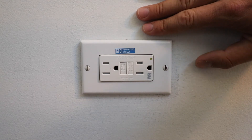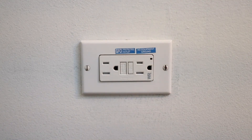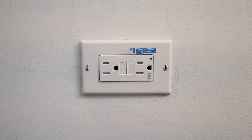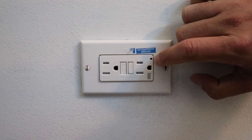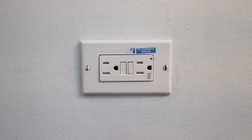If you don't have metal conduit and you don't have a ground wire — which is very common in older homes built before ground wires were run with electrical wiring — your GFCI will still operate and will still trip. The only thing you don't have is an equipment ground, so you would put the appropriate sticker on it. Without an equipment ground, if your GFCI were to fail, that electrical current has nowhere to go other than through you or the shortest path of least resistance. If you have an equipment ground and your GFCI fails, the ground wire still provides a path for current to travel through safely. This makes it even more important to test your GFCI regularly if you don't have an equipment ground.